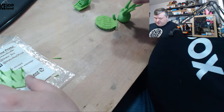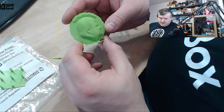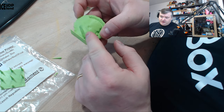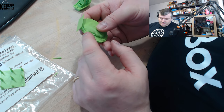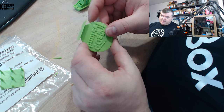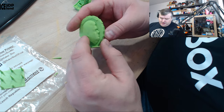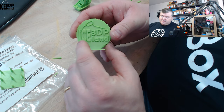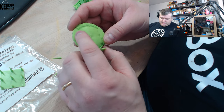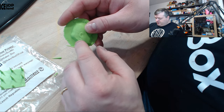Then I printed out my maker coin and that came out excellent for most parts, except the overhangs because the part cooling fan was off. There's a little bit of problems here with the overhangs, and I guess that's expected with steep overhangs and no part cooling. Other than that, the letters here in the back came out excellent, and the top side of the face was really good. So it was just the overhangs that had this problem.